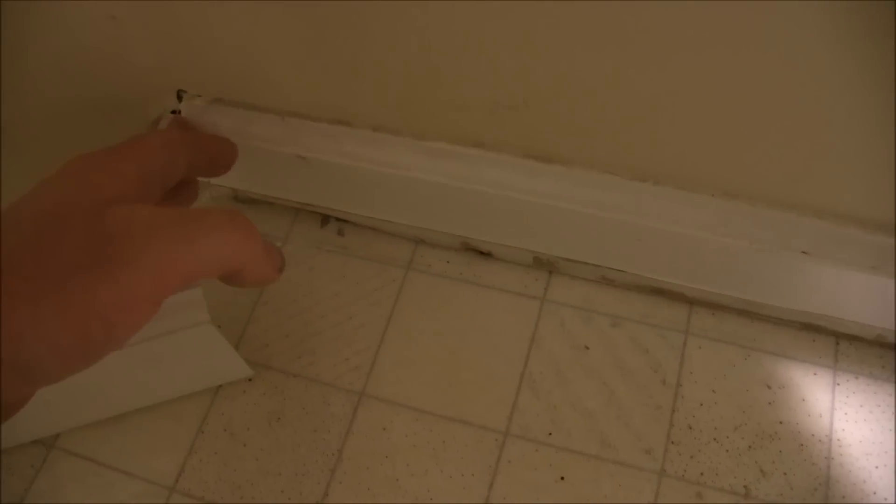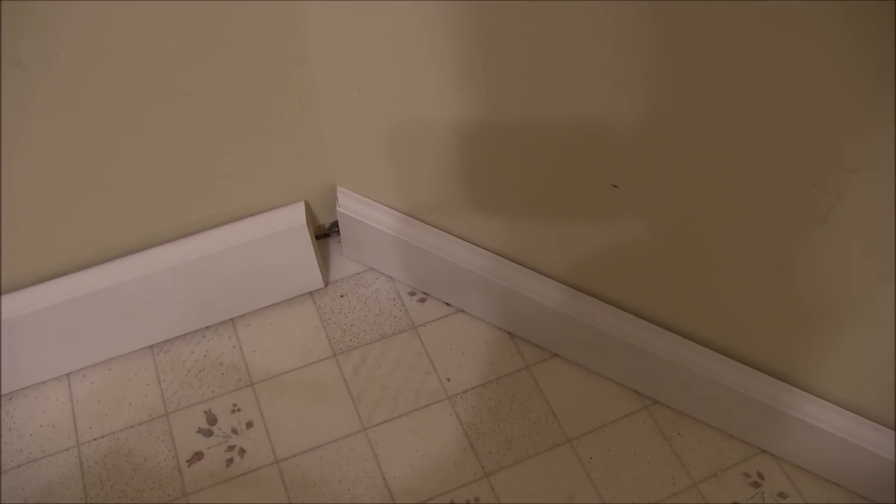See down here at the bottom, I've got a piece of baseboard that I've already cut — I haven't nailed this one in place yet. I cut it at 18 degrees and had to back-cope the end of the piece to get it to fit. On the other end I've decided just to 45 it. Now this angle here was different — checking with the angle gauge, from the reading we got, we ended up cutting these two pieces at about 23 degrees. Once I get them up there, that's going to be a nice fit. That formula should let you cut the correct angle every time. As we continue on with this project, I'll show you how to do an outside corner as well.